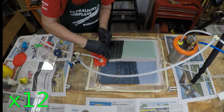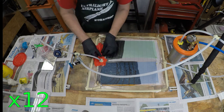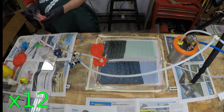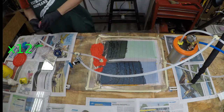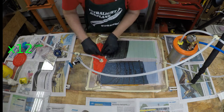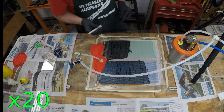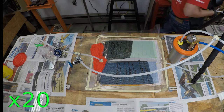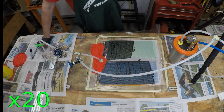I'm trying to make the bubbles visible — this is what I had been looking at most of the time before I gave up and plastered a whole bunch of Play-Doh on the vacuum bag. After watching a small leak still going through the blue side, I finally decided to cover as much as I could on the input side, putting Play-Doh anywhere else I thought it could possibly be leaking. After this big batch of Play-Doh, the vacuum leak seemed to really slow down quite a bit, and I was at least pleased that there seemed to be no additional air coming into the part.